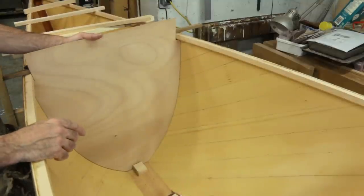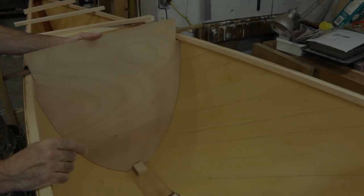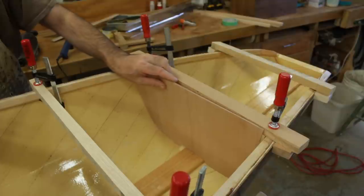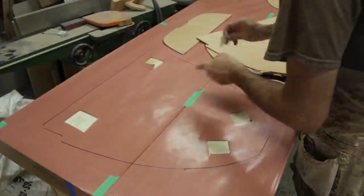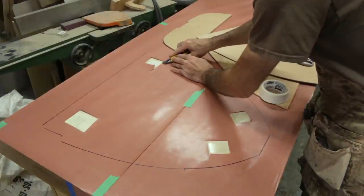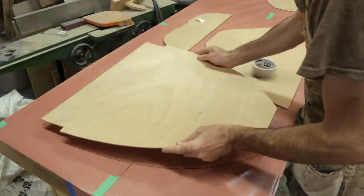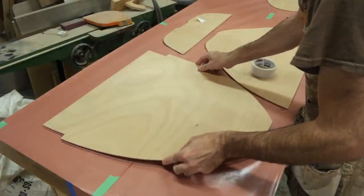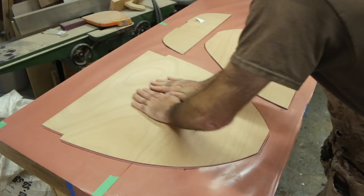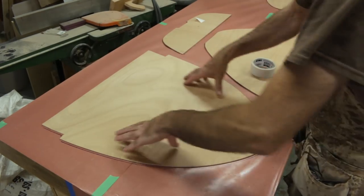I'm not going to bother trimming the top until it's finally fitted closer into place with a deck beam to describe that shape. I've got my aft bulkhead to finish up — it's pretty much ready to go — and two smaller ones which are already fitted in the back. My panels are a little potato-chippy and I need to glass them and want them flat when I'm done. I've cut some holes in my backing paper on the layup table and I'm going to double-stick tape these guys down to help keep them flat so I can lay the glass over and get a better result.